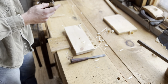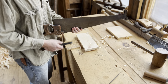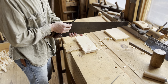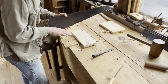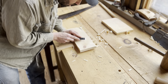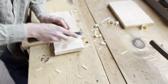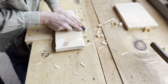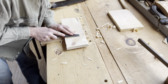The solution is to use a cross cut saw. A cross cut saw doesn't use a line of chisels — a better analogy is that it's a line of knives. So instead of having your cutting angle like this, it's got cutting angles like this. Half of the teeth are cutting this way, and half are cutting this way. So what you're in essence doing is slicing rather than bludgeoning. It's as if I want to establish a kerf here — I use my chisel to slice rather than going straight across. You can imagine how much easier it is to take a knife across the grain, rather than to try and do that. You can absolutely destroy your board.